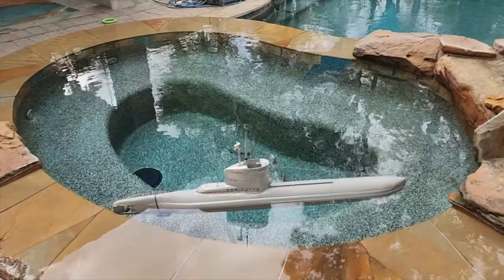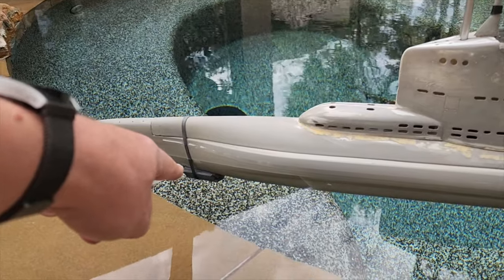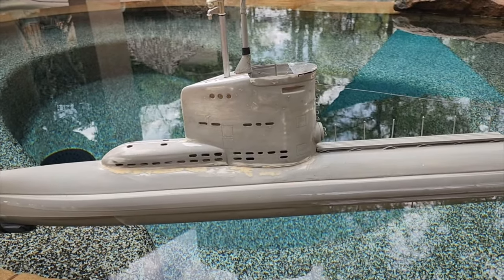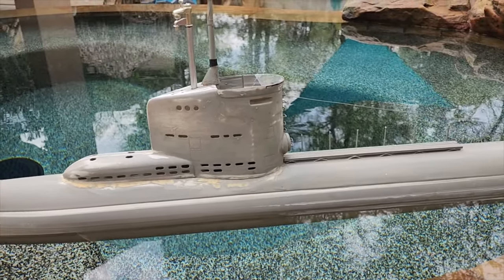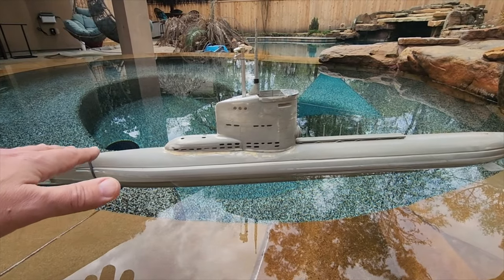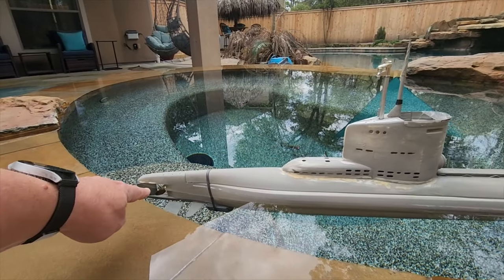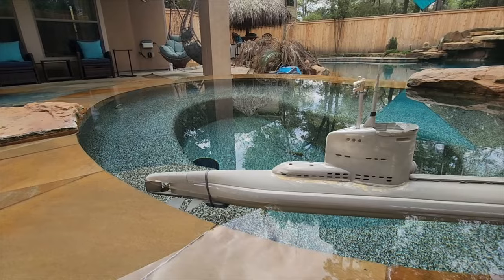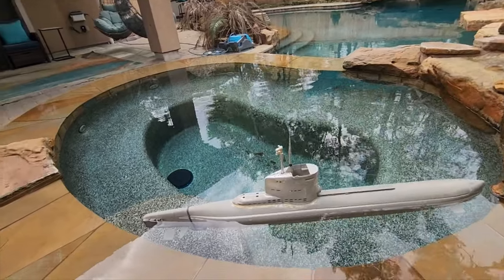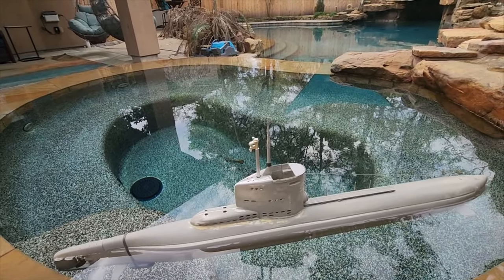All right, this is round two. I did put a whole bunch of weight in the back there behind the waterproof box, but it needs more. Got a whole bunch in the elastic band on the bottom there. This is where I want it to float. It's going to be right below the waterproof box, which means there's going to be no water pressure whatsoever trying to force its way in past those seals. And then I've got it just ever so slightly down in the back, and that just means it'll be less prone to sucking air with the propeller underway. But yeah, super solid. I think this is perfect. I'm going to see if I can find room for all that weight in the back, get that secured, and then we'll be moving on to some cosmetics.